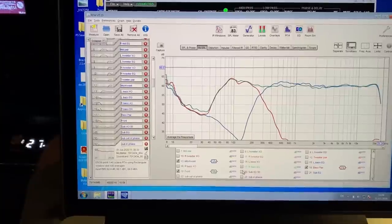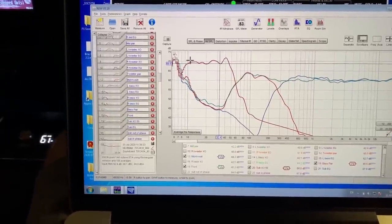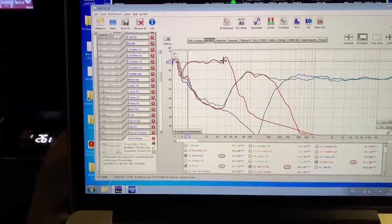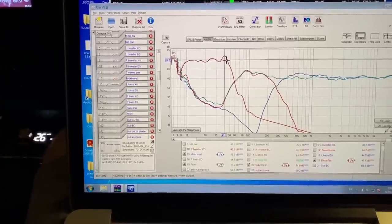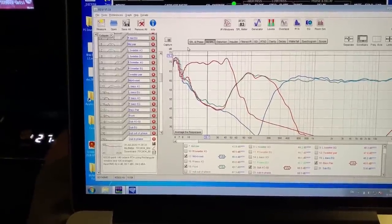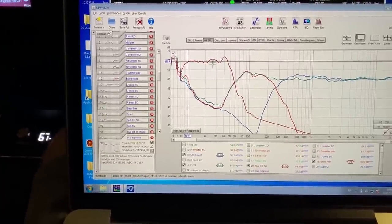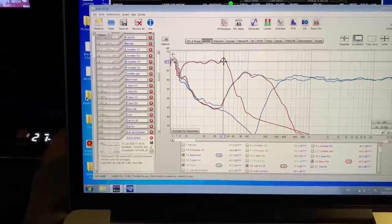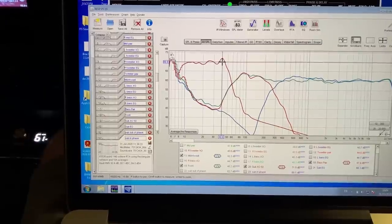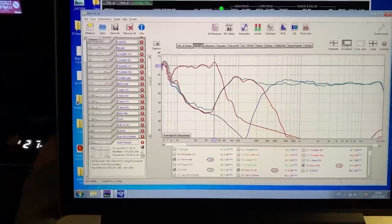The subwoofer was crossed at 50Hz and shows a beautifully linear response down to 10Hz. But to hear it linear you need an extra 3dB per octave of boost — if it's at a given level at 50Hz, at 25Hz it should be going up, and at 10Hz even further up. That's difficult, but usually only 2dB can achieve that in a car. There is a huge peak though: the car peaks at 40-42Hz and just pushes everything in that range like crazy — you can really go downtown and let the boot fall apart, as Gary experienced with his new setup.